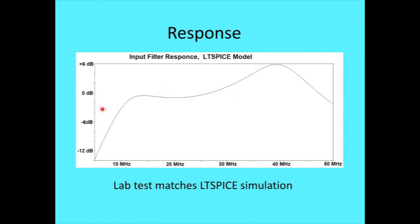And from that filter, if I just went capacitor to capacitor, matched capacitance, I would actually have a 6 dB loss. So that's a fair amount of additional help in signal level due to partially resonating it. And that helps cover up some of the noise of adding a resistor.